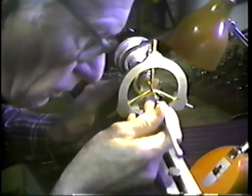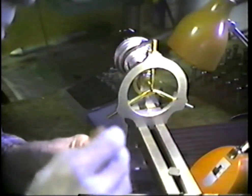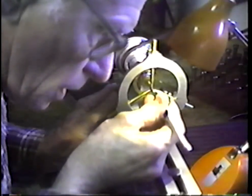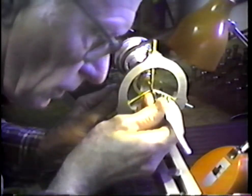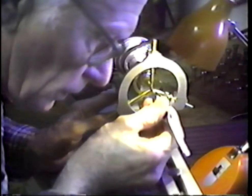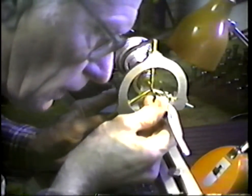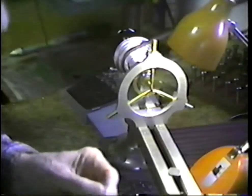It's not all that big a deal in drilling. As a matter of fact, this particular pivot is not too hard to drill. The material is quite hard, but it is free machining. These drill bits I have are very good, very sharp bits, and it's not a particular problem in doing it. The hole's going in very straight. I feel no tremor whatsoever in the handle.